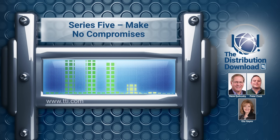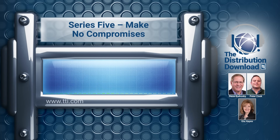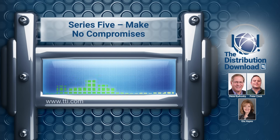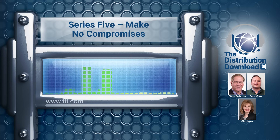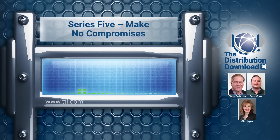A question I get asked pretty often is: is Series 5 a mil-spec product? It is not currently a mil-spec product. However, it does use pre-existing mil-qualified components. As an example, it uses 39029 contact part numbers, it utilizes Series 2, 38999 inserts, and it's also compatible with 85049 backshells. So while it's not currently a mil-spec, we were able to utilize existing qualified mil-spec components in developing this new series. Do you ever envision Series 5 becoming a mil-spec product? Possibly — we're certainly open to it. We've consistently proven ourselves to be a supporter of open standards, and if there is enough demand for an open standard for Series 5, Amphenol is certainly supportive of that.